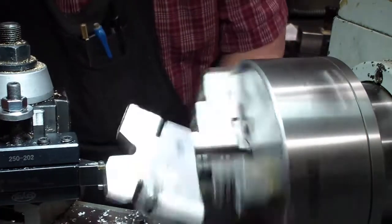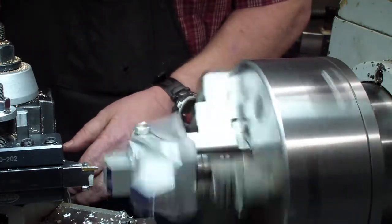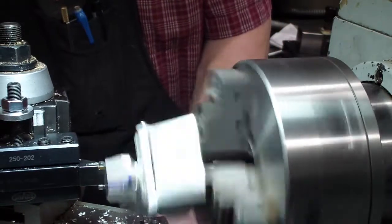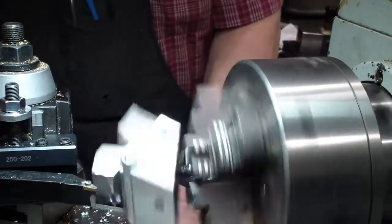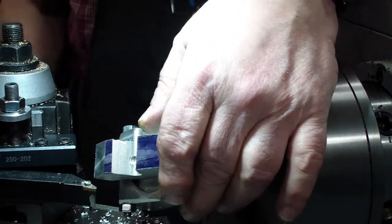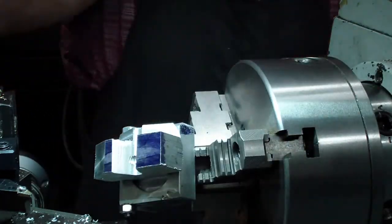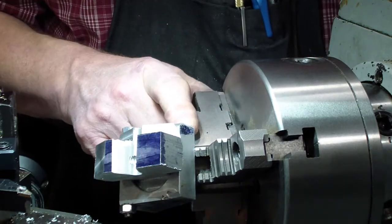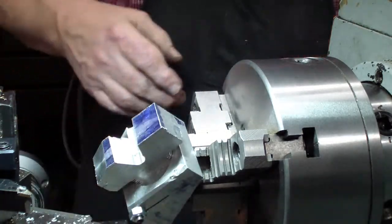This particular operation really tests the holdability of your clamp system. And I'll tell you right now what happened there: the clamp held just perfectly, but the bolt twisted out of the jaw. So what I'm going to need to do is develop a more rigid bolt so I can hold it in there tighter. And let me check it out first.